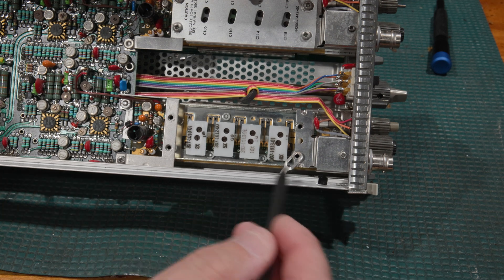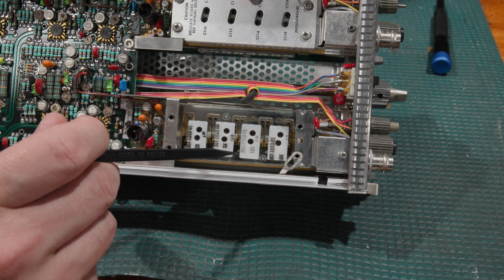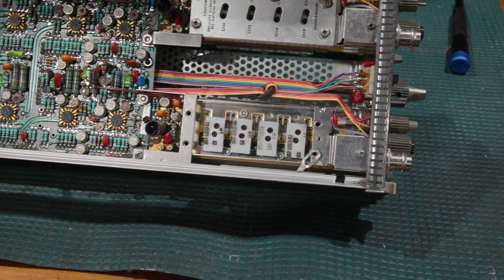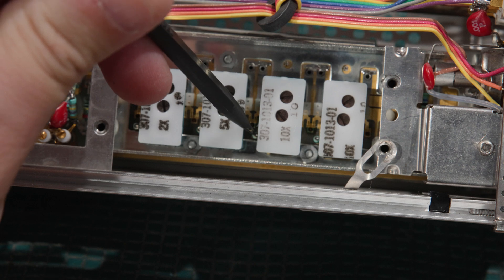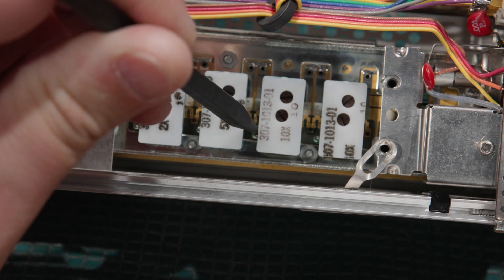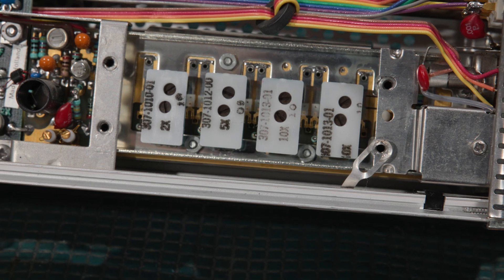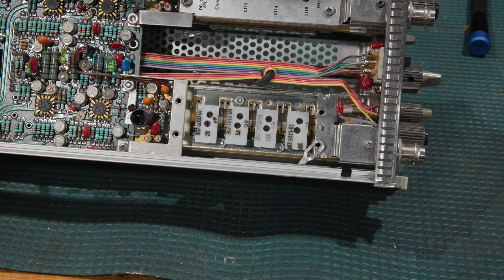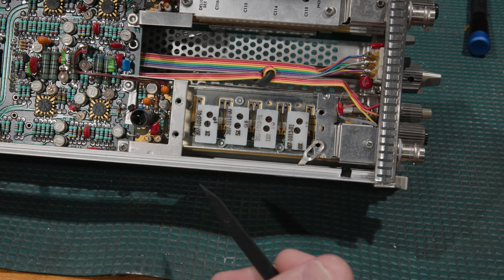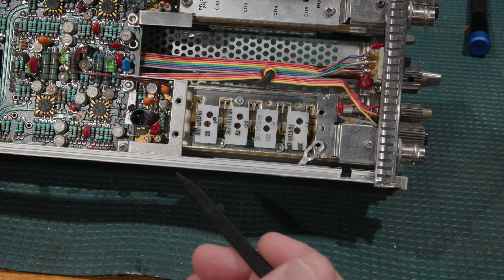I have seen attenuators where some of the coupling resistors — which are hiding down here in between, I'll zoom in on that — you can just see one of the resistors peeking out right here next to the capacitor tuning. I've seen one of those resistors burned in half before and the plug-in still functioned. The capacitor bank needed to be replaced, but once I replaced the resistor and the capacitor bank, everything was functioning normally.